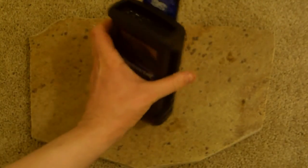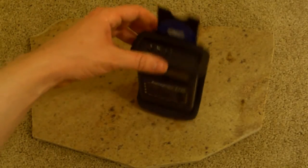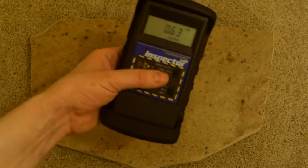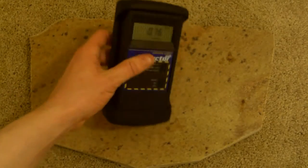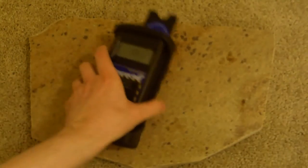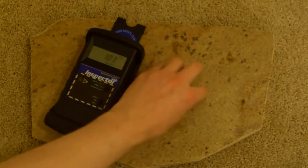It's very, very wonderful. It allows you to set the unit upright. The unit will stand reasonably well. It kind of pendulums back and forth. I always feel scared to let my unit fall, but this thing is a lifesaver for bumps and wear and tear and so on. And you can detect gamma like this, pop this open, detect alpha without the slightest bit of problem. It recesses the detector, so you don't have to worry about liquid spills and stuff being a problem.